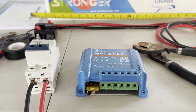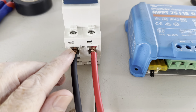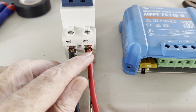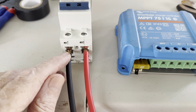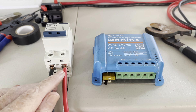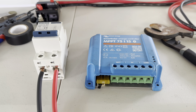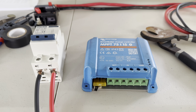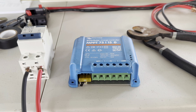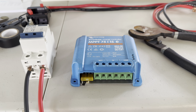I'm going to snip the wire to fit. The other thing I'll do is use ferrules, which make a nice clean connection as opposed to just putting bare copper strands in there. I've done both and never really had a problem either way, but I will put ferrules in before mounting it permanently. For right now I just want to get all my wire sizing and lengths cut to specification for the project.